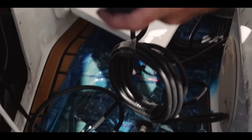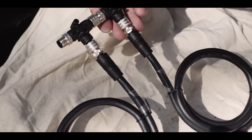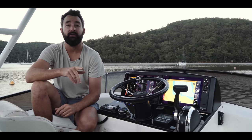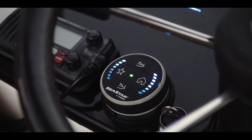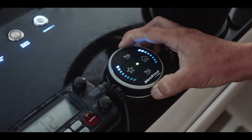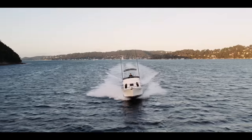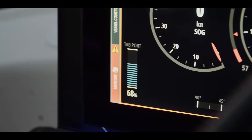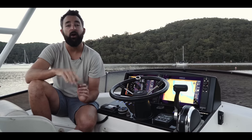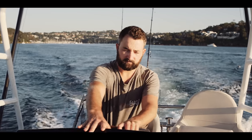It's a digital system with inputs sent via a dial at the helm. Signals are sent by the CAN bus network to the actuators that dictate the trim position. There are also pre-programmed positions for takeoff and optimum cruising. The dial replaces the trim tab switches, and adjustable LEDs indicate the tab position. You can turn the dial manually to level the boat as conditions change, removing any roll. Crucially, the beauty of this system is it won't change the pitch of the boat — it only changes roll — so fixing one problem doesn't create another.